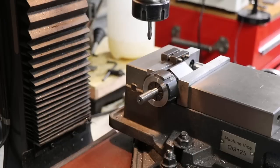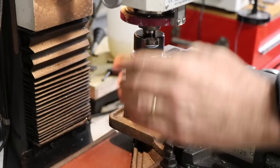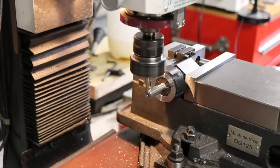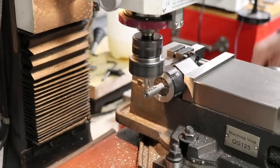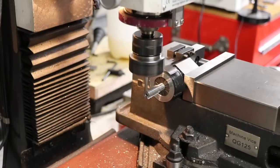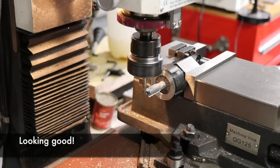The next thing is back to the milling machine to cut some flutes into the tap. The first thing to do is to line it up on centre using the Bruce Witham technique of balancing a ruler on the diameter — when it's level it's in the middle. Then we just chomp through the steel until it looks about right, trying to get a good sharp angle on the cut.